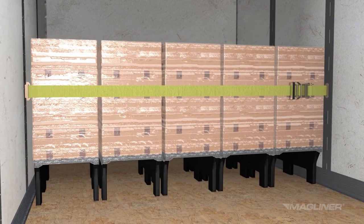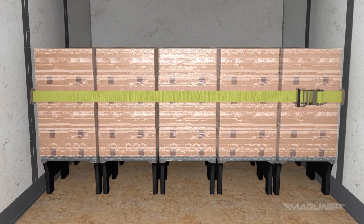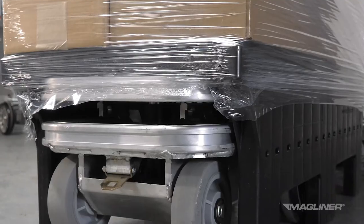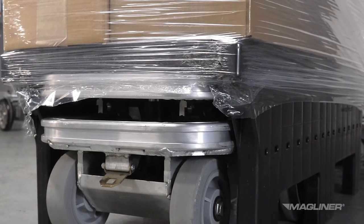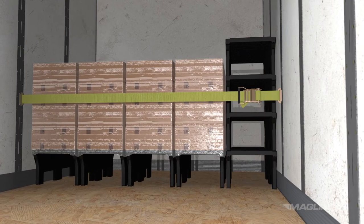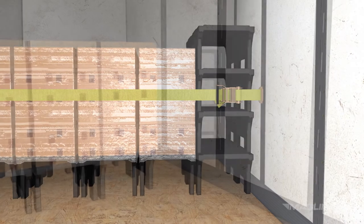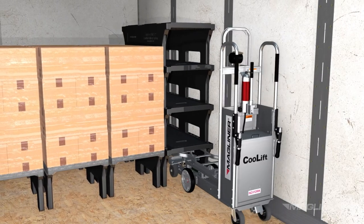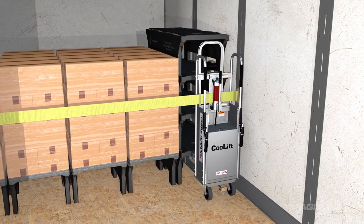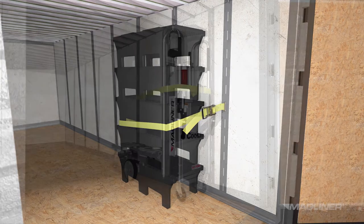Load the pallets lengthwise into the trailer. Secure each row of loaded pallets, including the final row, with a cargo strap or a load bar. Once the trailer is loaded with pallets, insert the CoolLift completely under a fully loaded pallet and toggle the up switch until the lift deck makes contact with the bottom of the pallet but does not lift, then engage the holding brake and turn the unit off. Secure the CoolLift with a load bar or strap. If a row of pallets does not span the width of a trailer, a stack of empty pallets can be used to prevent the short row from shifting during transit. The CoolLift can also be fully inserted underneath the pallet at the end of the short row to prevent shifting — just remember to engage the deck with this pallet and to engage the parking brake. Empty pallets can interlock with each other for transport back to the trailer and while being stored in the trailer.